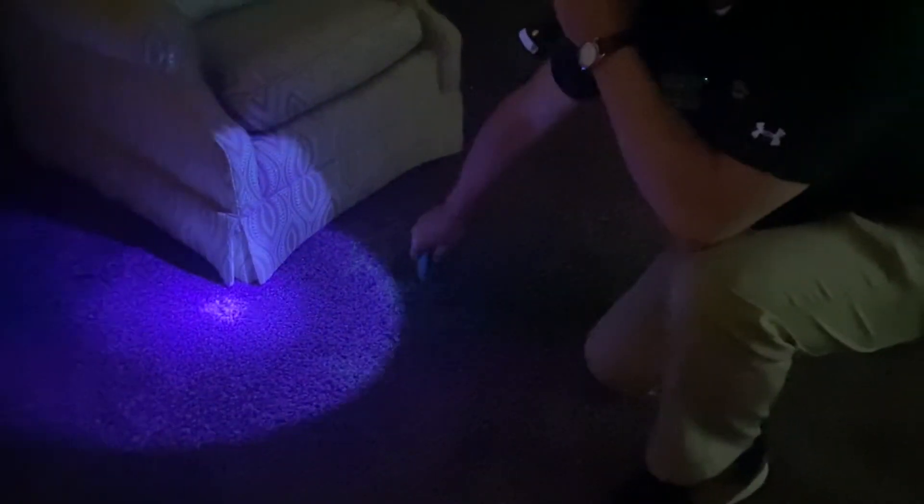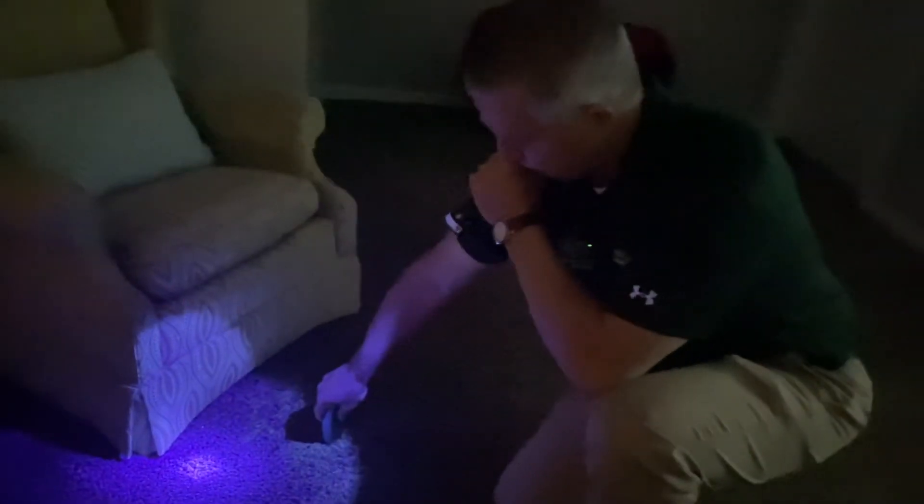The hydrophilic salts — which I will detect with my moisture meter here — when we probe these you can hear it go off, that's our little pee alarm. That tells us there is a presence of hydrophilic salts, and those are problematic because they draw humidity into the carpet, especially in the spring and summer times. As we get more humidity it starts the off-gassing process again, so that urine is coming back up.